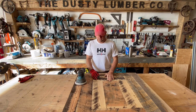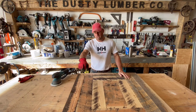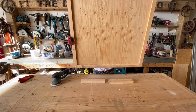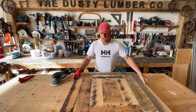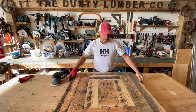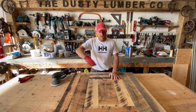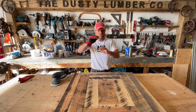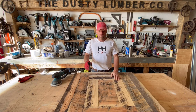This is a tabletop I worked on — I have a video of how we went through and did this. It's a square table with rabbit edge cuts around the outside and plywood on the inside, with thin planks on top. That gives me a nice live edge barnwood look on the outside and a solid wood-looking table. Because I've re-sawn all this wood and have the thin planks with plywood underneath, I've really limited the volume that the cavities in the boards will take.